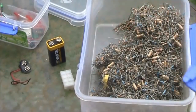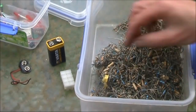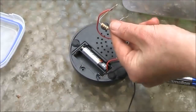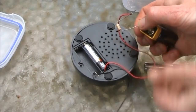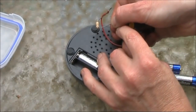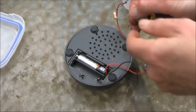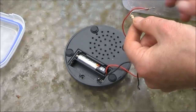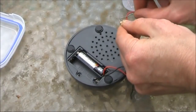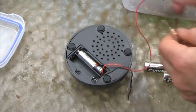We can either use resistors or diodes. Resistors may produce a different effect because of their voltage drop. This is a 150 ohm resistor — we'll just use it in conjunction with a 9 volt battery. The volume is a bit less, but we need to add some more resistors, because when you get below a certain voltage or you restrain the current, you may get some different effects, which is what we're looking for.